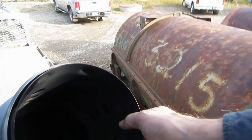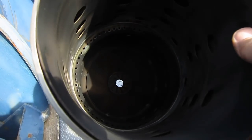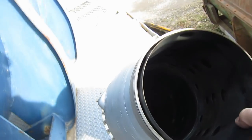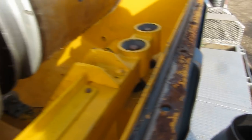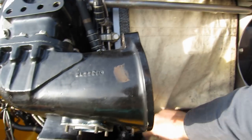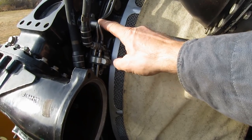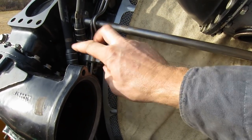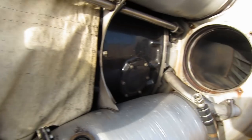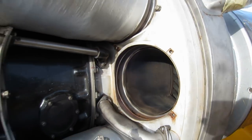Let's see if we can look down inside of the combustor liner — can you see inside there? It looks like any other combustor liner, doesn't it? Here's where we took it out of. This is like a transport blanket or protective blanket for the compressor inlet. You can see the fuel manifolds right here — this is starting and that's main. These are the individual fuel lines that go to the fuel nozzle. And the sun is helping out — we can look inside. There's the turbine nozzle. This engine's in great shape.